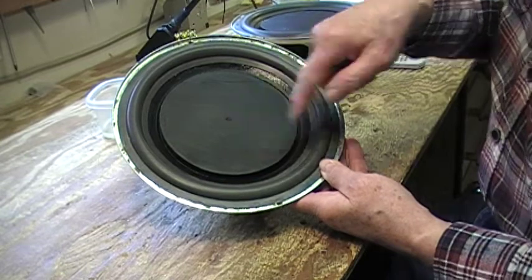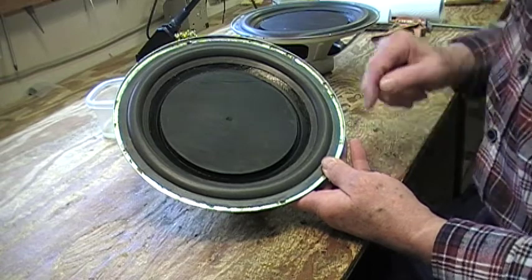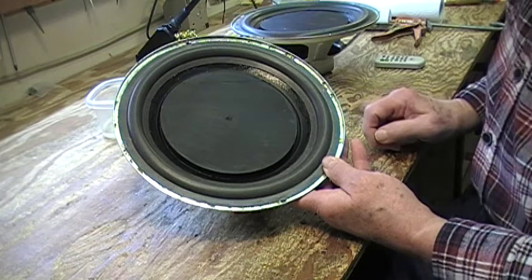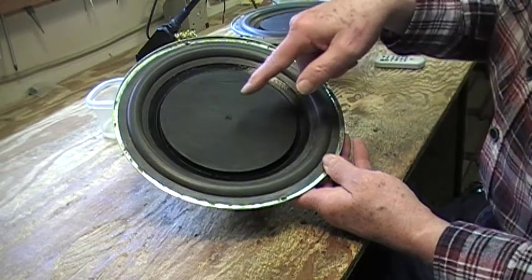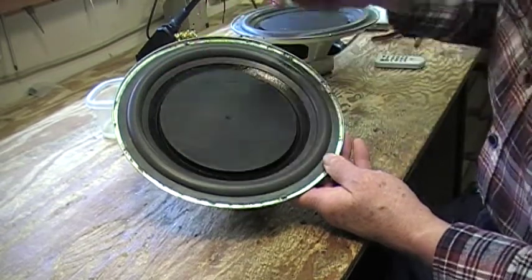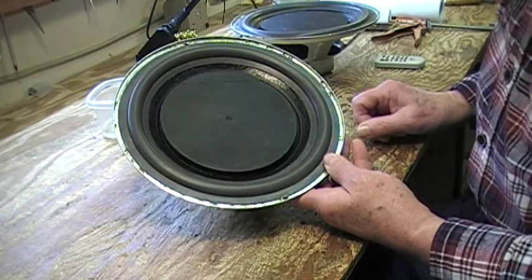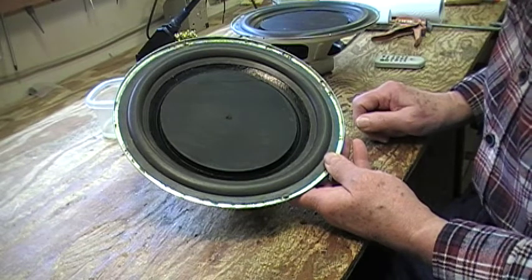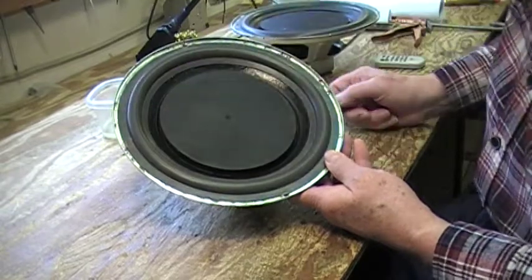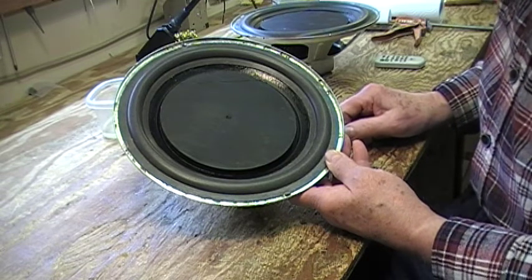You can see maybe the remains of the hole in there — I drilled a center hole, which was part of the process of cutting the circle with my router and a circle-cutting jig. I mounted a bolt on there and tried to true up and clean up the outside edge to some degree. I'm not sure exactly how necessary it is to be perfect. Then I applied a liberal amount of woodworking glue and glued them in place and let them cure.